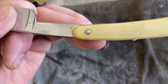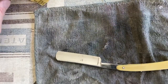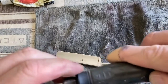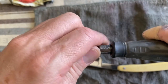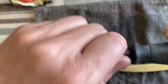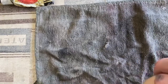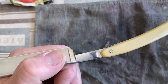Remember, rusting causes the metal to stain — we call that patina. The more aggressive or deeper the rust was, the bigger the area of metal that would have eroded, leaving a little crater or what we call a pit. To get rid of that you need to take off a lot of material, so find a balance of what works best. This is a polishing wheel — I just want to quickly show the results of just buffing that up quickly.